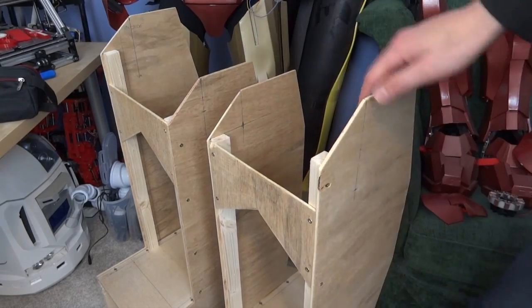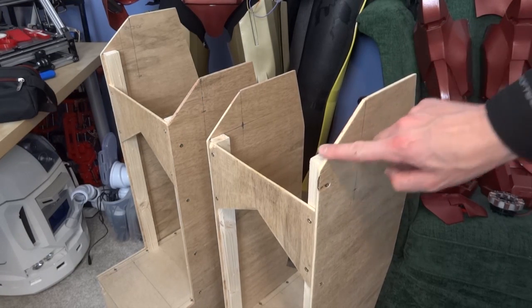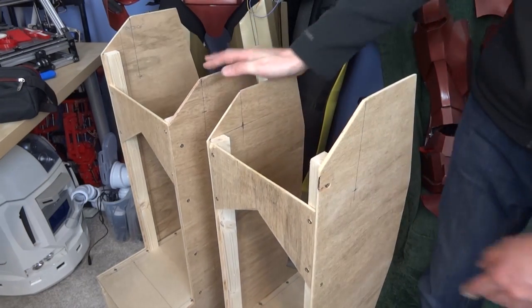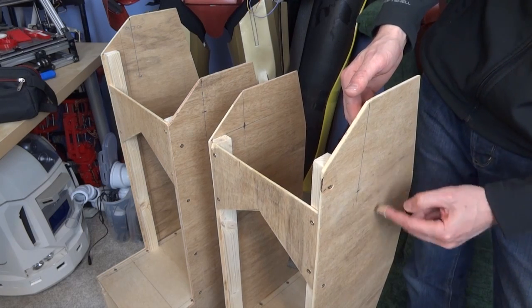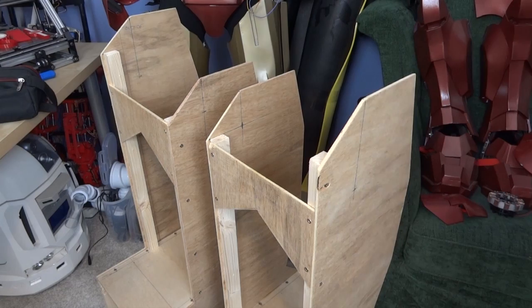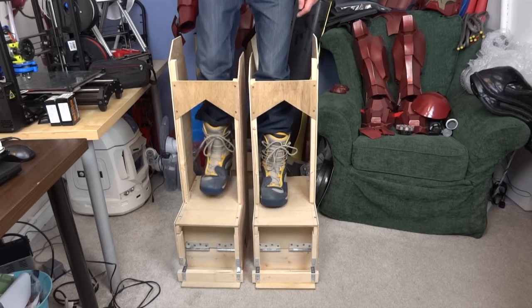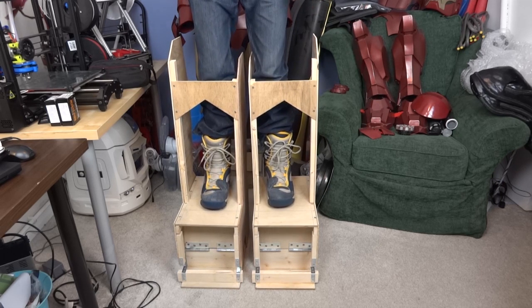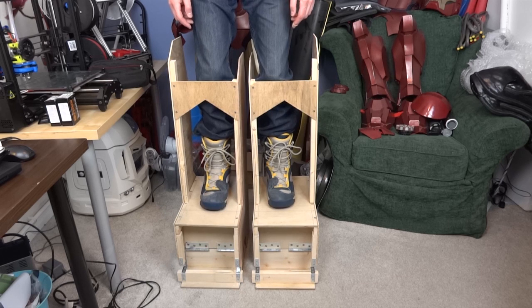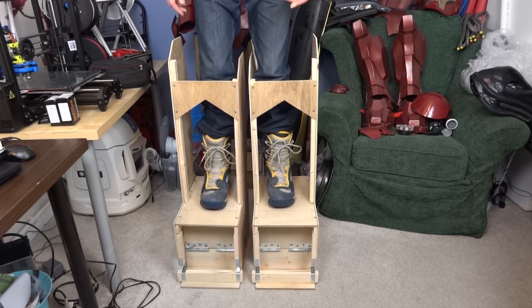There are two substantial chunks of wood that support the weight of the wearer on the back. Looking at the top, the next section up will be a thigh hinge, and there's a much higher knee piece on the outside — so this is the knee and the next piece will be the thigh. There's a lower one that fits in between the wearer's legs, and the outer one is bigger so we can have a big hub with a pin from the thigh piece to lock the joints in place. Locking all joints is crucial so we can climb out and leave it freestanding. These make quite a substantial base with no wobble — unlike regular stilts which have a parallelogram mechanism that moves with your own ankles.